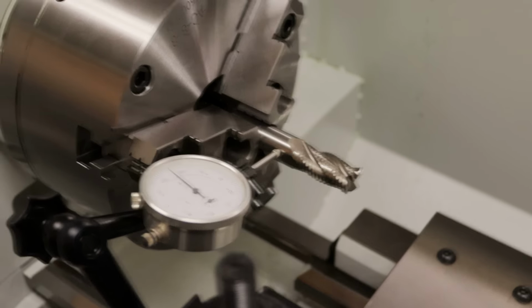Now that's a really nice finish on there. That's very smooth. Workpiece is getting hot, but so 30 thousandths we are at 980 RPM. All right, so that's much better finish. And the tool is breaking the chip pretty well. I'm not getting too many long stringy chips. Of course, chips everywhere. All right, I got to clean up the chips.